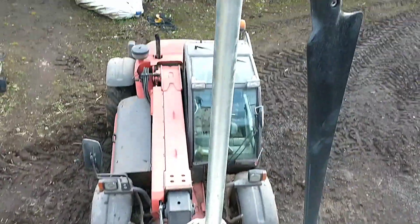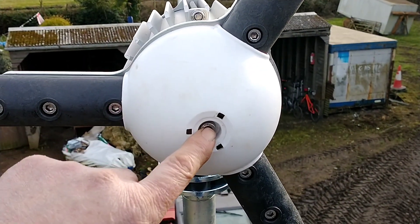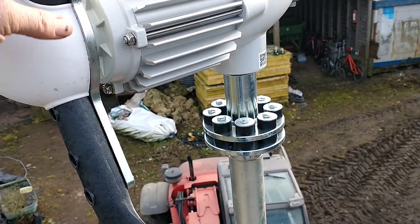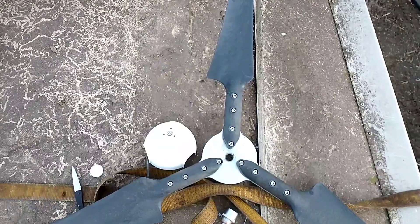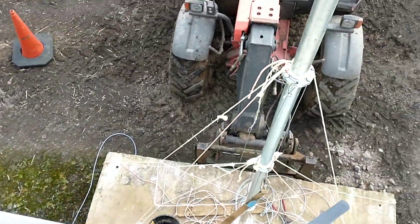We're going to try and work off the container roof, take out that nose cone pin, and then it'll reveal the nut that holds the flange on. Good old rubber mallet — and I greased the shaft as well when I put that on — so it wasn't too bad.